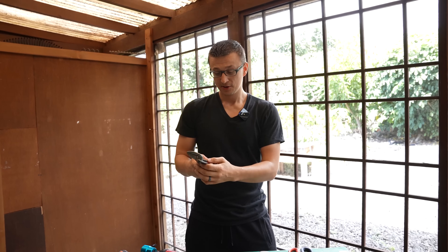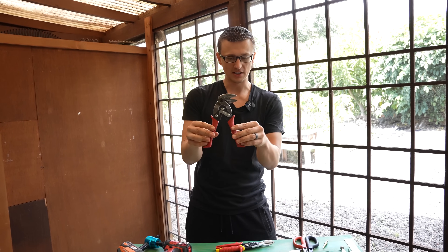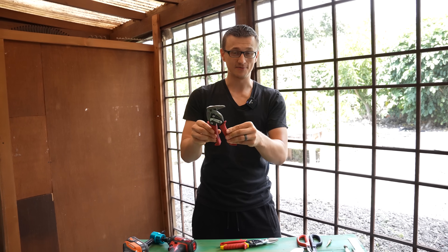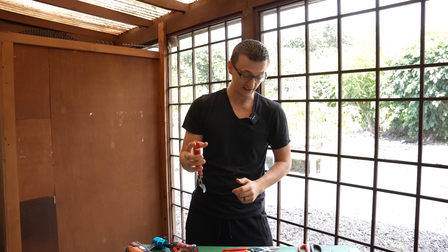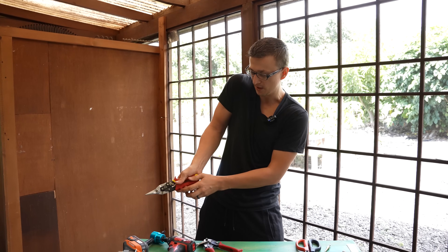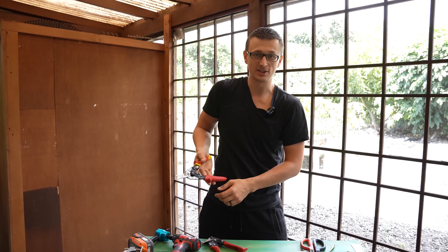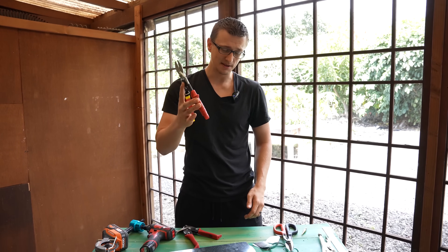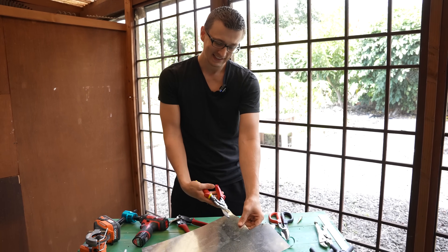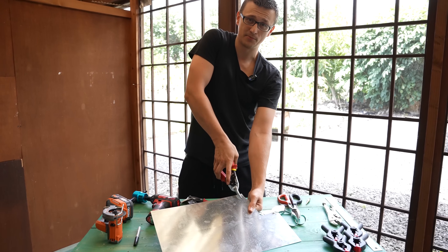One last thing about the snips: there are some old tools out there that don't have the spring in them. See how when I press this it just springs back? That is the type of snips you want to have. There are some snips that don't spring back, and it's really annoying trying to cut sheet metal with those. Because every time you have to release the handle, go again, release, go again — it gets really tiresome. Also, if you have a cheap pair of snips, sometimes they can pinch the sheet metal — they kind of go sideways instead of actually cutting it. In that case, try to angle in the opposite direction, and that should solve that problem.